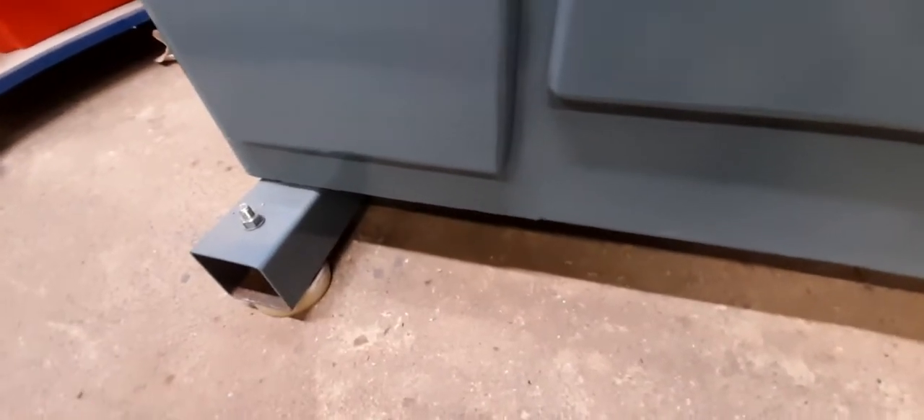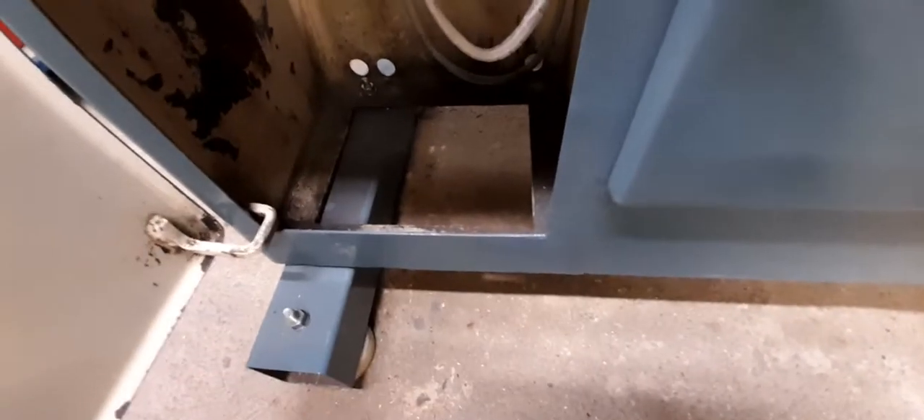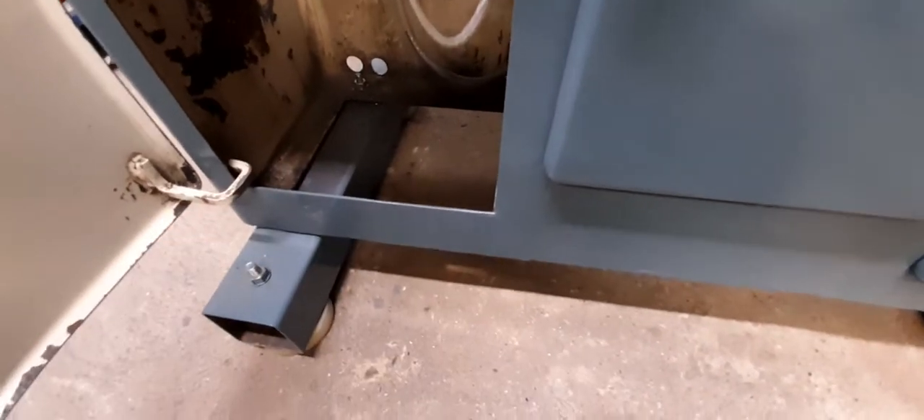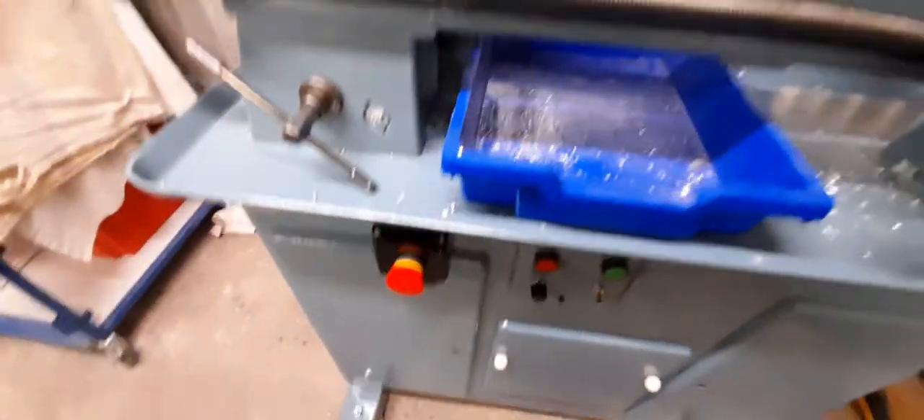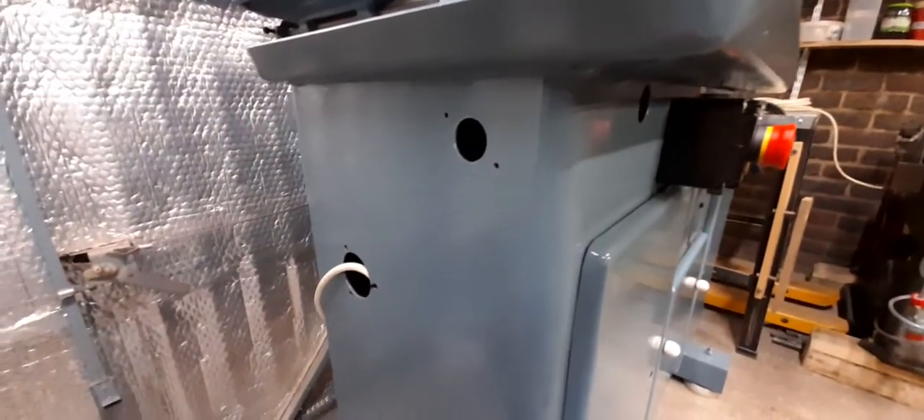If I find the lathe rocks on the floor I'll just lift it with a pallet truck and put some packing under there to level it out. Someone might criticize, but normally there's a foot in the back corner not straight like that — I just drilled it out because that's the way I wanted it. I don't quite understand why the feet would be narrower on the front than on the back, but that's the default. Underneath I've welded on some additional pads to make it a little bit stronger. All around the cabinet there are additional holes — I'll probably make some infill panels. This was actually an underdrive cabinet, so it's not authentic to the lathe, but it looks all right.